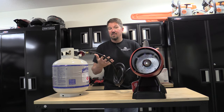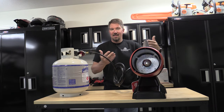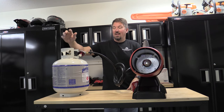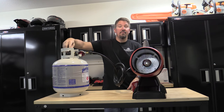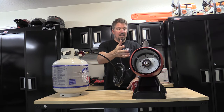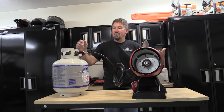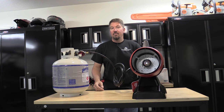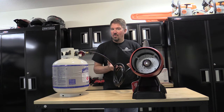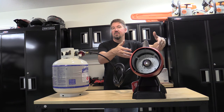As far as smelling it here once it's burning, I don't smell a lot of fumes. I do have the door open but being this close, no real fumes. To turn this off, it's highly recommended that you just turn off the gas. That's going to allow everything in here to burn out. The heater will do its thing and eventually you'll just have the fan running, then you can flip the switch and turn it off. You wouldn't want to turn it off with the gas still running — the thermocoupler in there is going to be warm and will still let the gas out.